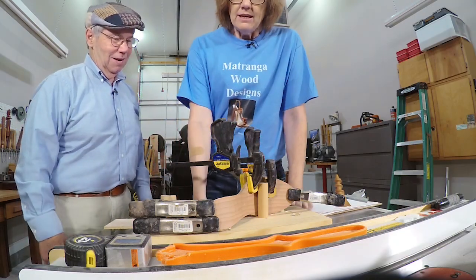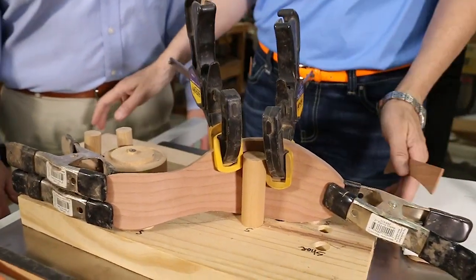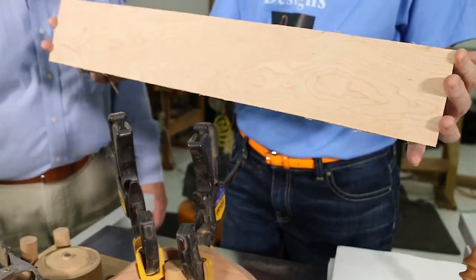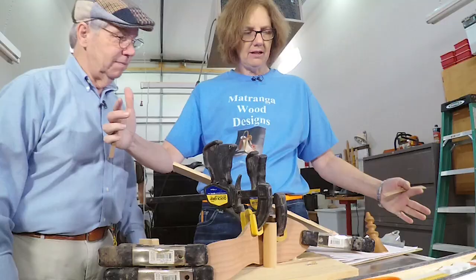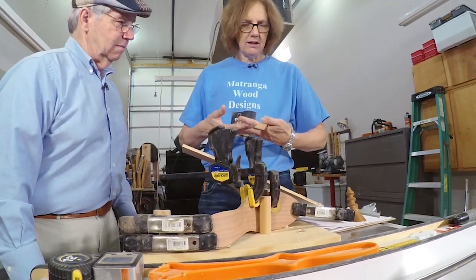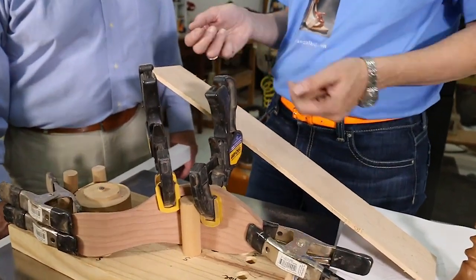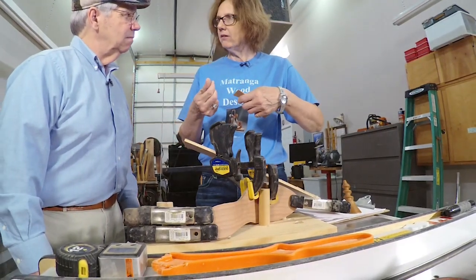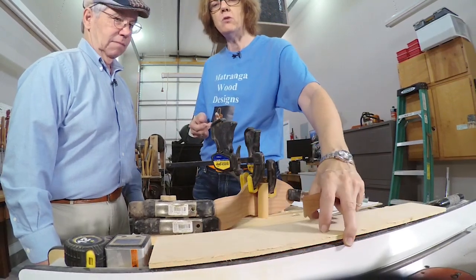This is very interesting. Well, I came upon some wood that's called compressed wood, and it looks like any other board. It comes in large boards, and this is just cut down a little bit. But what happens is they use hydraulic presses and actually compress the wood fibers like this. And so it doesn't have anything to do with moisture content or anything like in traditional bending, but it makes it easier to then bend and let those fibers pull back out. So when I discovered compressed wood, it just opened up so many possibilities.